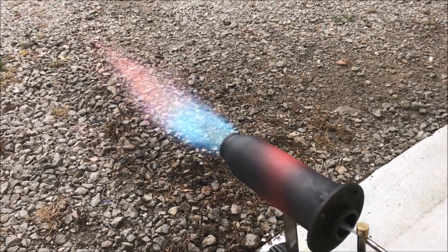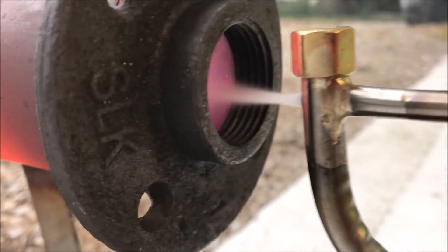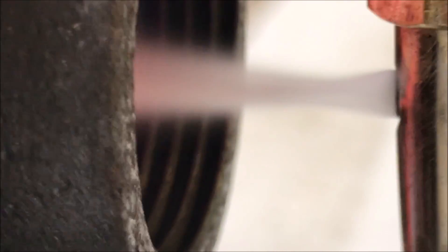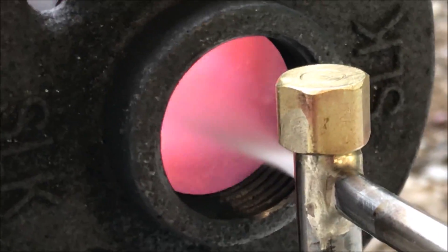So far so good. This is a little bit bigger than I think I want it to be. However, let's check the nozzle out — look at that vena contracta, that is so awesome. Performing very well — awesome nozzle. This thing can get nearly red hot without having any problems. That's a 45% silver brazing rod, that's not a solder, so this is a very robust nozzle.